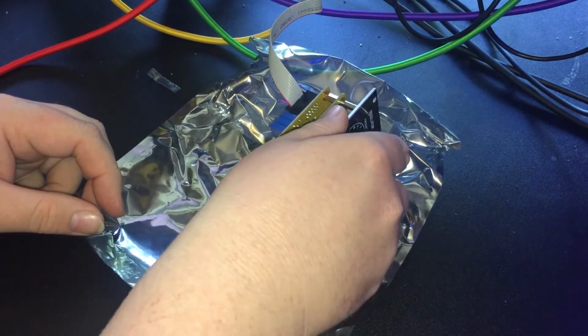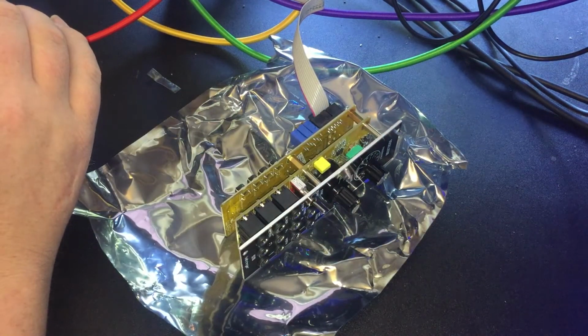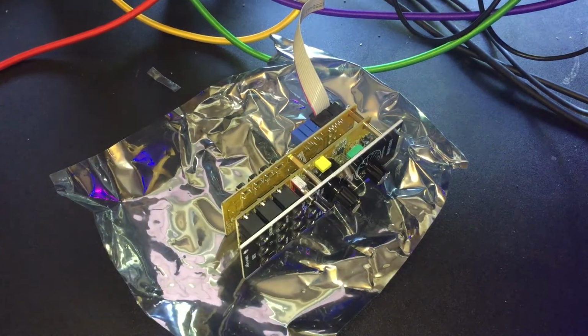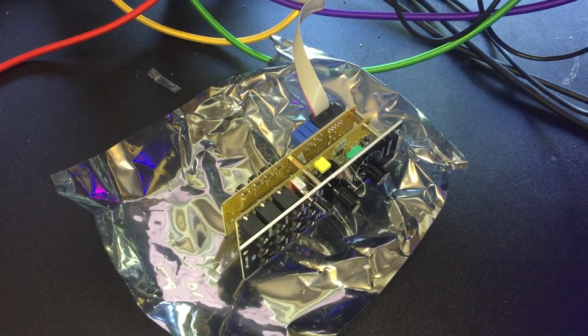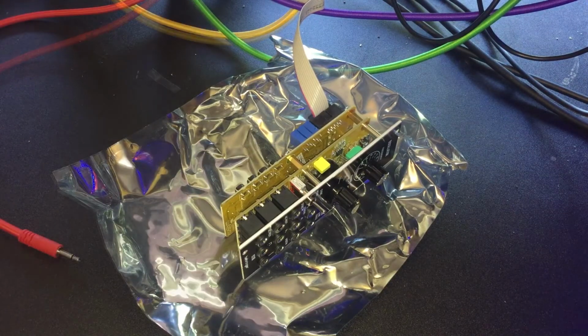Carry out an initial frequency control calibration by adjusting the frequency trimmer so that the 921B sawtooth output shows exactly 640 hertz. Okay, let's get my tuner up. Where are we?